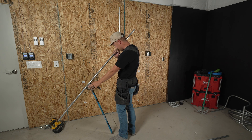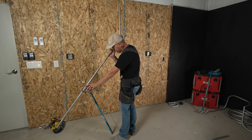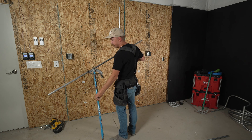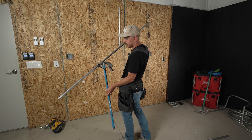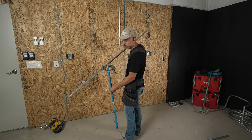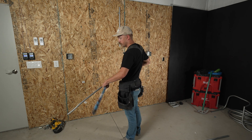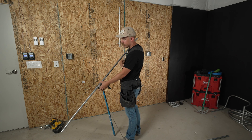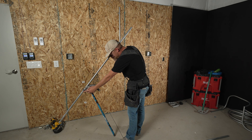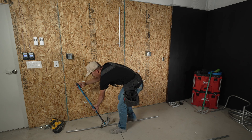So I'm going to look down — does my offset still look like it's about 90 degrees off of this plane? And it does. My mark looks good. I'm going to hold pressure on everything. The reason that's important is if you go to rotate this over but you don't hold pressure on anything, everything moves around — the conduit twists, it slides in further, and it just isn't going to work. So get lined up again and hold pressure so everything stays together.